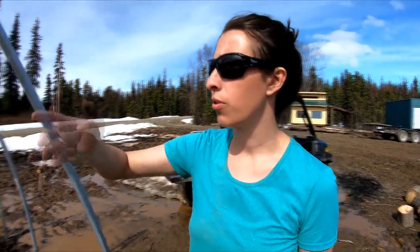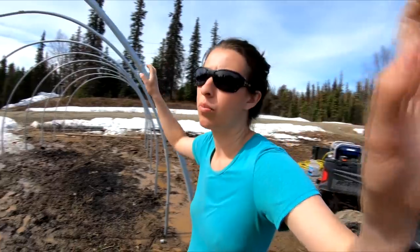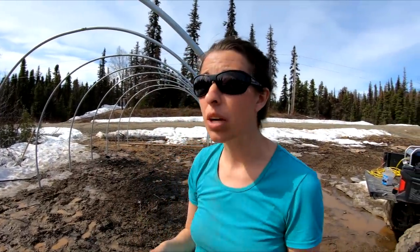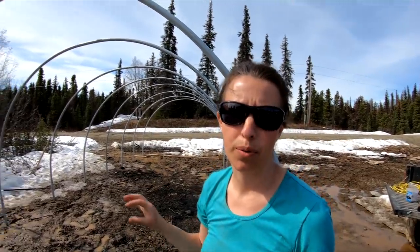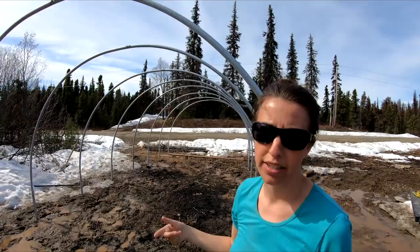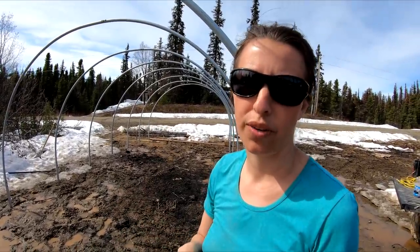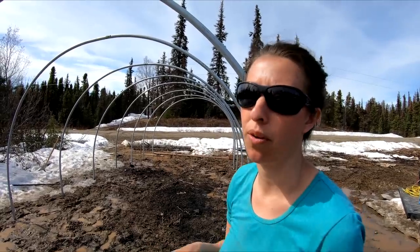We are also going to put 3 support beams throughout this hoop house, and we are going to be adding wind bracing, which goes on the side, and I think we're going to be adding a hip board. We're not quite sure. Traditionally, that's where you would put wiggle wire if you had roll-up sides. We're not going to do roll-up sides. It's just kind of being a little more low cost with not doing it that way, so we're still debating about the hip board.